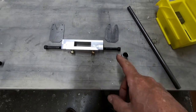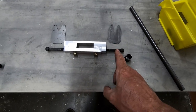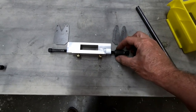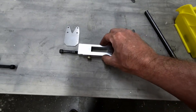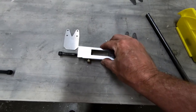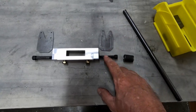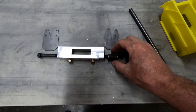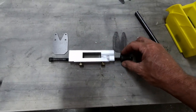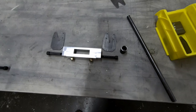And I believe what the designer was really intending those bushings to be for is to act as a maintenance-free bushing that you could attach the landing gear here, and then as you hit the ground upon landing, your landing gear will rotate like this a little bit. As your gear flexes, these will rotate. And these bushings here, which are attached and fixed to the fuselage on the outside, and then attached and fixed and bolted to the inside here, that rubber will turn and rotate in there and allow some flexibility between the inner and outer shell of the bushing. Now, I believe that's the primary purpose of those Polstra bushings.